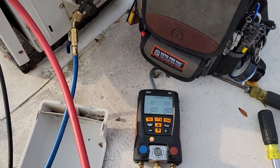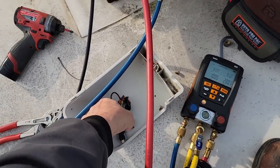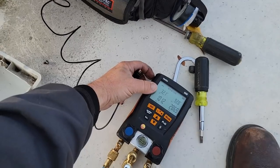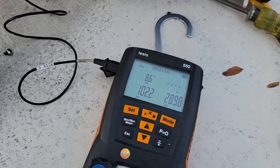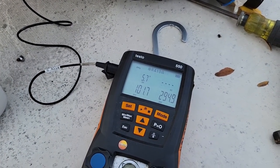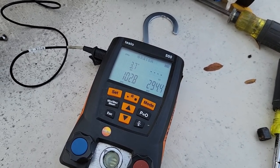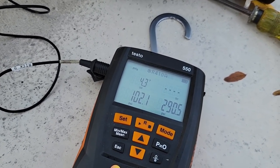We could check superheat. Since this is just a generic system — definitely not a fancy inverter — all the rules about can't do this or can't do that go out the window. It's about 15°F superheat a minute ago. They do have an accumulator on it for a reason. It's getting down a little lower than I'd care to see, but it's been like that. It's definitely not overcharged. I've seen these Mitsubishis run some stupid low superheat before. Come on back up to the happy zone — there we go, bring it on up.